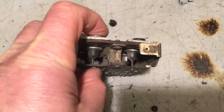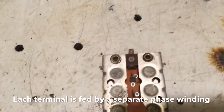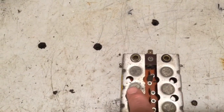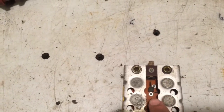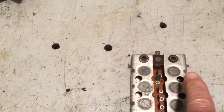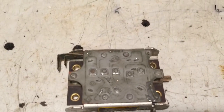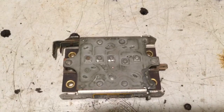If you look down the side you can see that the diode is soldered to the printed circuit board. Where my thumb's tapping you can see where one of the diode terminals comes through and touches the printed circuit board, as do these phase terminals. Each terminal is connected to one part of the printed circuit board and they are bridged by the PCB across to each diode. Those three connections are linked together, as are those three, and as are the three on the other side.